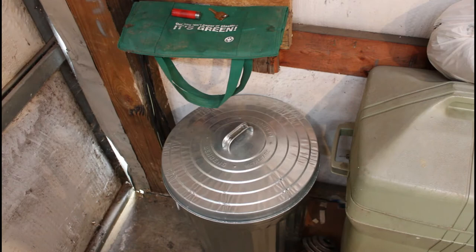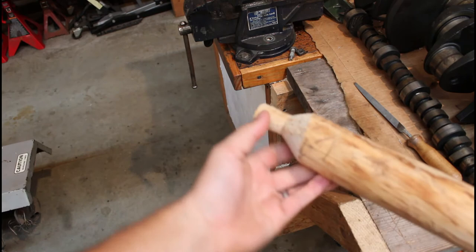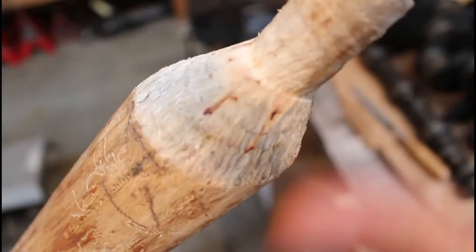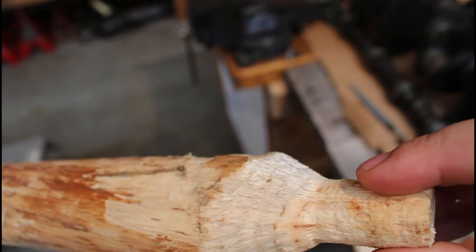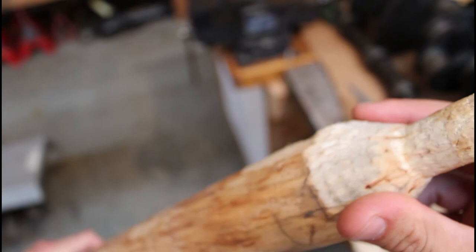Let's take a look at one of the logs I cut. This here was one of the cross members for the bed — I had to remake this one because as I was assembling it I managed to break it. You can see this is a one inch tenon. The finish that the cutter leaves on here is not fantastic — it's pretty rough. On the tenon itself that's fine, because if you're gluing the wood together that gives more surface area for the glue to grab onto. But on the angle leading up to the tenon, that's a visible part, and you want that to be smooth.